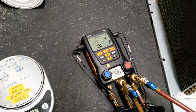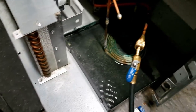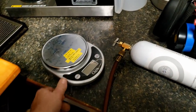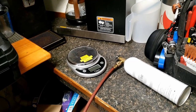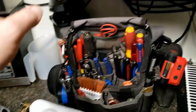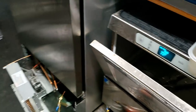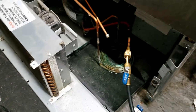We're now running 33 pounds of pressure, which is equivalent to an 11-degree evaporator. That's going to rise a little bit once it starts to stabilize, which further confirms it was low on refrigerant. This little scale here you can get on Amazon - I used it for my food scale when I was losing weight and measuring everything I ate. It's cheap, and it's in my parts description along with three or four different tool bags plus my Patreon. We're running a 20-degree evaporator so far - beautiful compared to what it was.